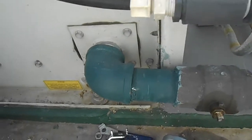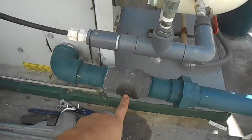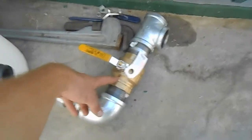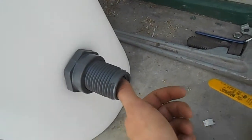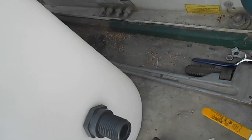Right there is the drain fitting for the tower. So we're going to T off of there with an isolation valve. We also have another valve over there — we're going to replace the tower drain. We're going to T off of there, connect that to there as normal. We've got the short nipple here, two-inch isolation valve, close nipple, elbow, one-inch union to take the tank off if we need to, and it's one-inch insert into the left-hand thread on this little bung adapter. So that's going to mimic the water level in the tower — we're going to reproduce that right here and have the same level in this tank as whatever is in the tower.